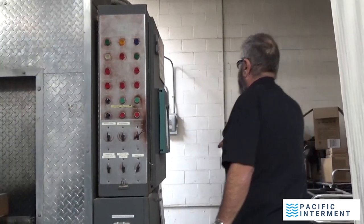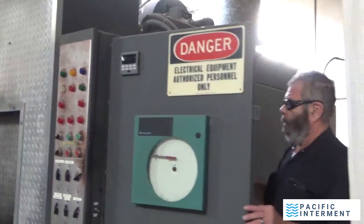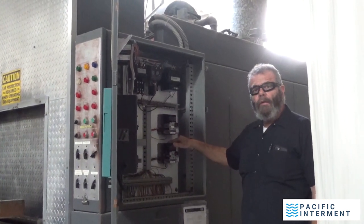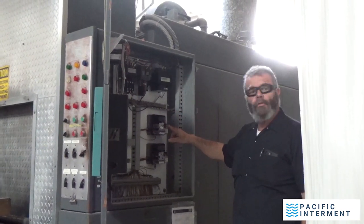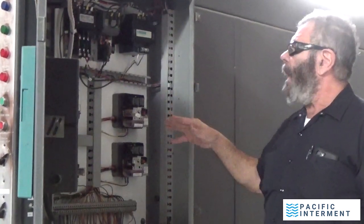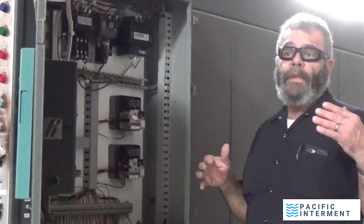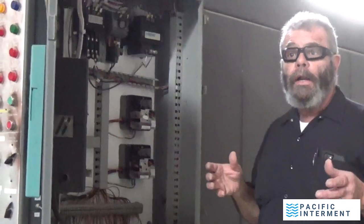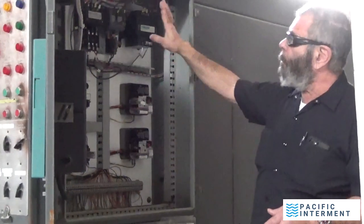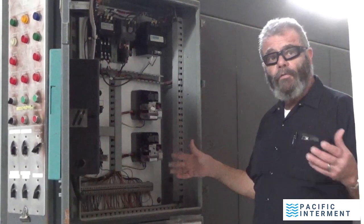And the afterburner reset, sometimes this burner will not kick in right away. So you'd have to go into this panel, and there are these two boxes in here. They're flame control boxes. This one controls the afterburner, this one controls the cremation burner. If you get a reset on either one, you go to the appropriate one and you press this red button, and you'll hear it click, and it takes sometimes 2 or 3 presses before it actually resets. And then that'll have this machine go through its whole clearing cycle, which it has to do to make sure that the ignition flame is on before it dumps all the gas into the chamber. So there are a lot of safeguards, and this is the brains of the operation right here on this machine. The thing that safeguards our safety and the community's safety, as we're doing this job.